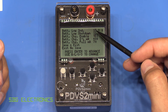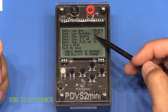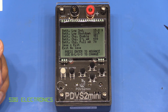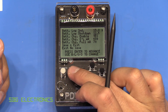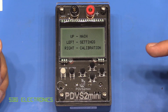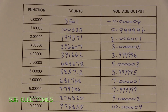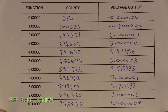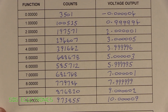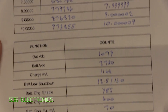There is a menu structure accessible by pressing and holding enter. In the settings you can configure the voltage at which you get a low battery warning, the voltage at which it shuts down, and charging details such as turning charging on and off and setting the charge current. Once the battery is full you can set the maximum current pumped in. You can save or discard your settings, and there are also calibration details. Ian sent a calibration sheet - he calibrated the device with his 8.5-digit multimeter, and if you lose the calibration data you can program it all back in.